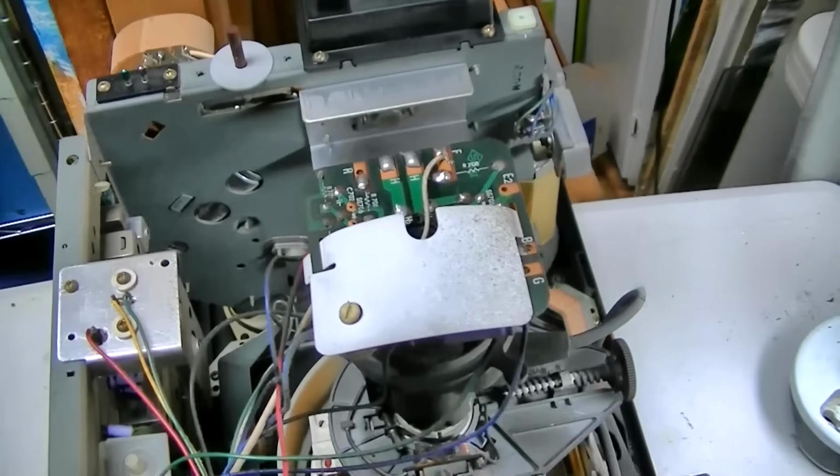this is professionalism here, but I'm trying to make sure your tip is very dirty and has chunks. But yeah, just sort of take and move the solder away from the holes. And that way you can just stick the new one in. Again, observing the polarity that the negative goes on the bottom. This is really not hard to do. You really don't need $50,000 worth of equipment.